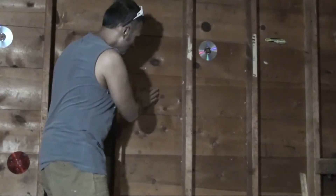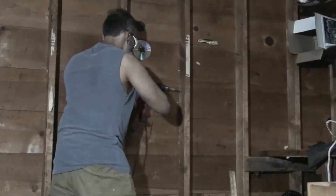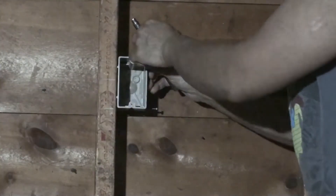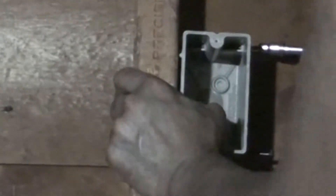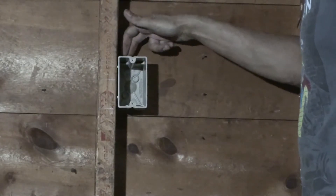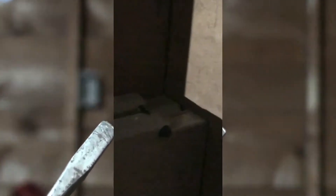When you do this you've got to be careful — there are a lot of nails on here, you don't want to get your hands too close to the nails while you're drilling. Now we can go ahead and install the outlet. For this one, do not use a screwdriver, use a socket head. It's firmly in place. I need to create a little opening on top for the wire using a small flat head — you don't want to use a big one. I'm going to put my screwdriver here and tap it with my mallet and create a little indentation.